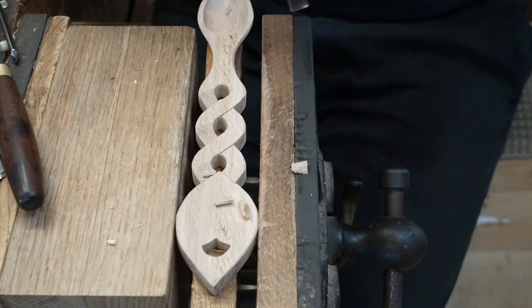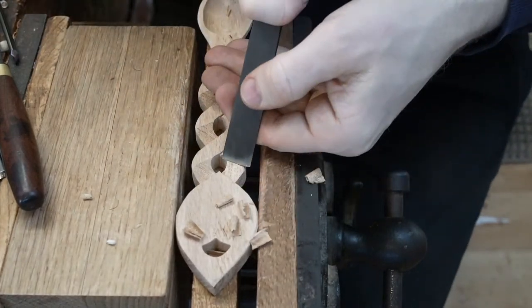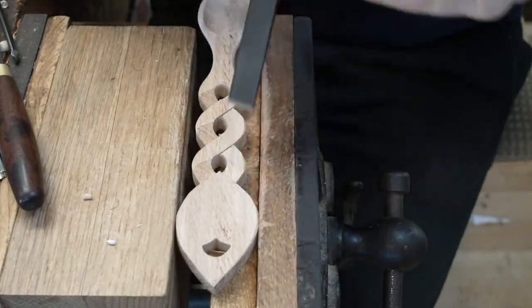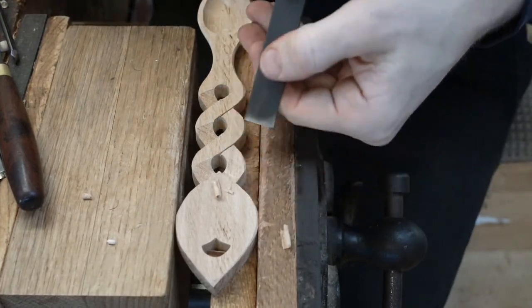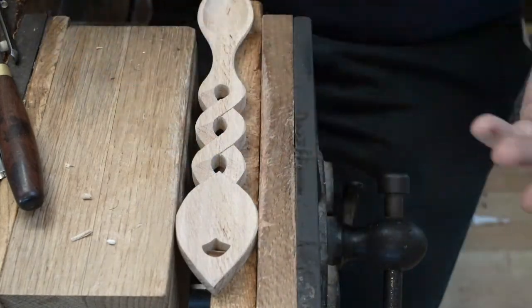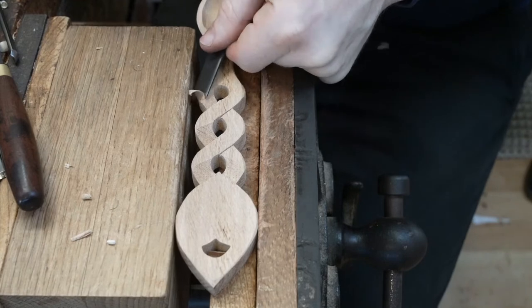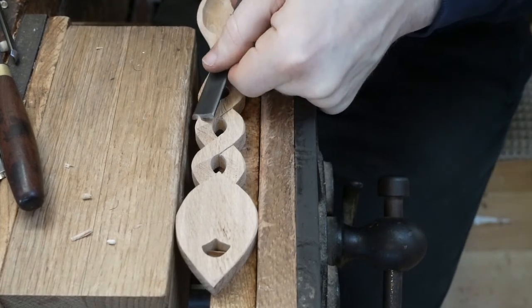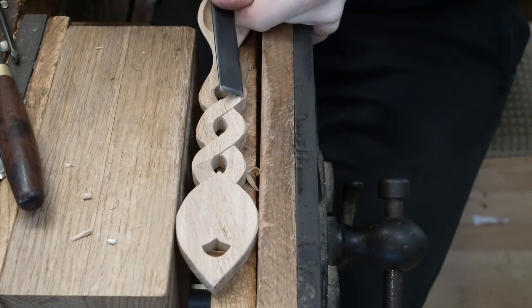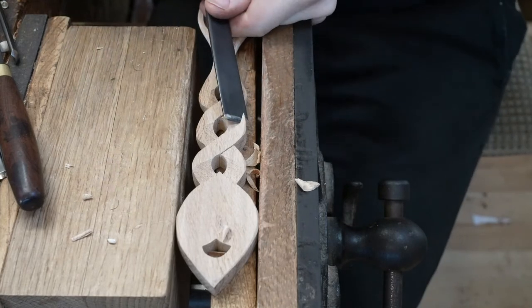Going back to sharpening — we use a Tormek, which is a really good system. For sharpening, we generally use external angle gouges: sharpen on the outside edge, you get a little burr on the inside, take the burr off, then strop the metal to polish it up until you get a sheen. If you're only doing carving as a hobby and looking for an inexpensive method, I'd suggest getting a little slipstone and a leather strop. I've seen people on Facebook groups saying they're having to sharpen every five cuts — if you're having to do that, something's not right. You should be getting a lot more time out of a good sharp gouge than five cuts.